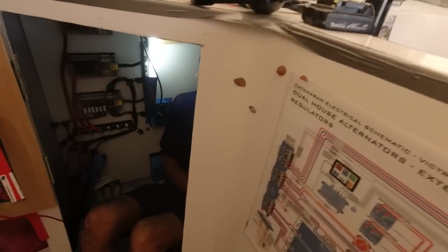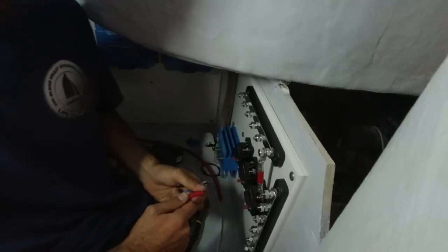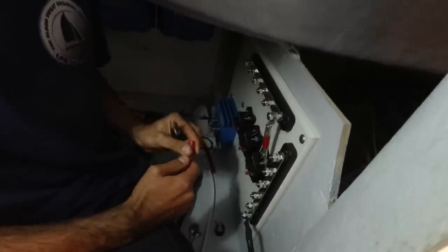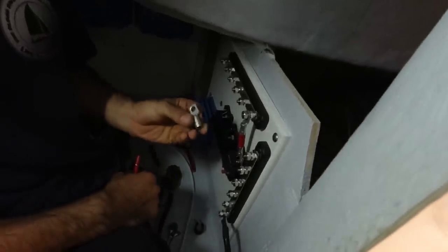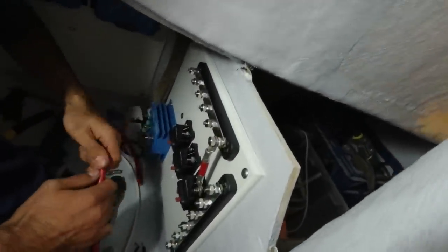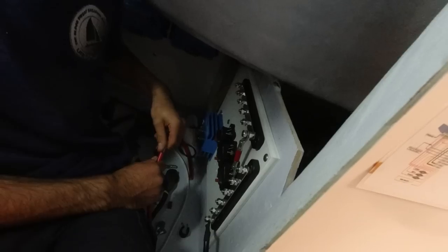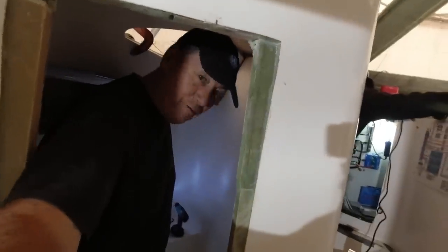He's having a rethink — doing some nice mods. This is our high load board. We had to space it out — you've got to allow for the crimping, or allow for the fact that these things don't bend, and the terminals are that big, so you've got to factor in that length times two. Once you've got a short piece they just really don't have much bend in them. With the four-ought wire we're using, there's really not a lot of room in there — it's filling up pretty quick.